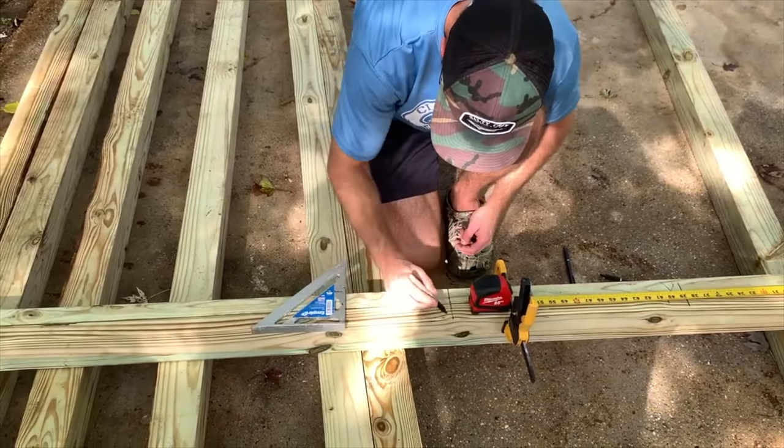You'll have a lot of variability with the angle you choose, and it obviously depends on what kind of angle you have going out. Mine's very shallow. What I'm showing here is kind of like a 5 to 8 degree angle, and you can see that's pretty close to what I want. It'll kind of come out and end here. If you've got further to go down, you can cut a steeper angle. This is a 25 degree angle, and as you can see, that would need to be like that to be flush. So you have a lot of adjustability.